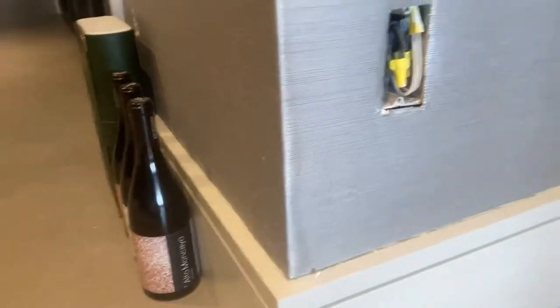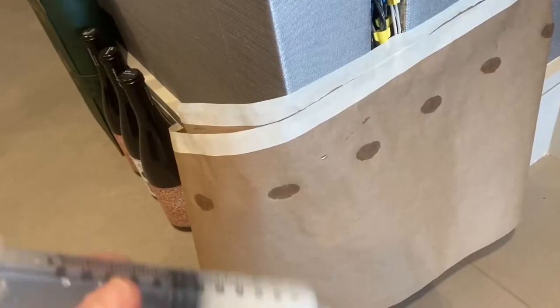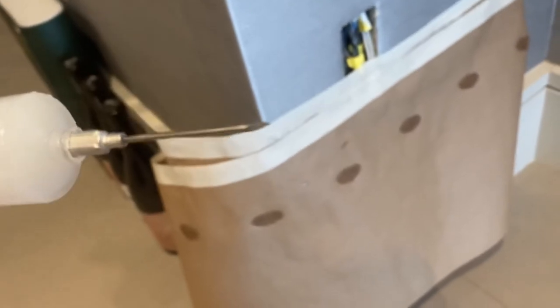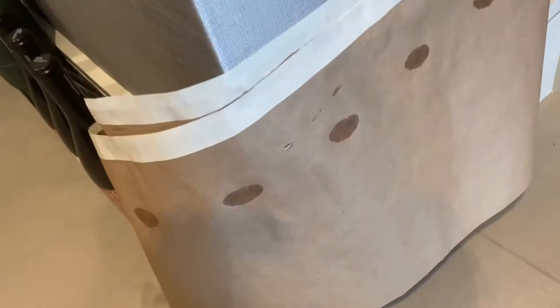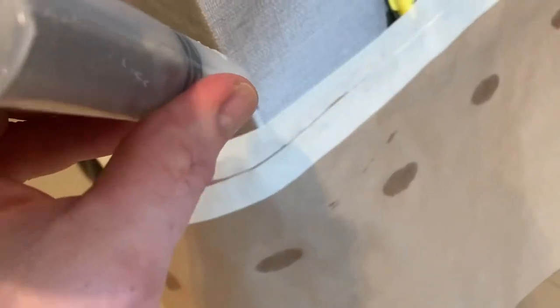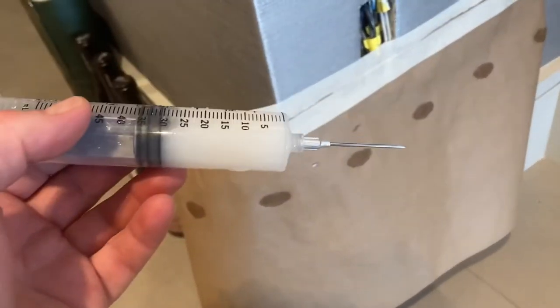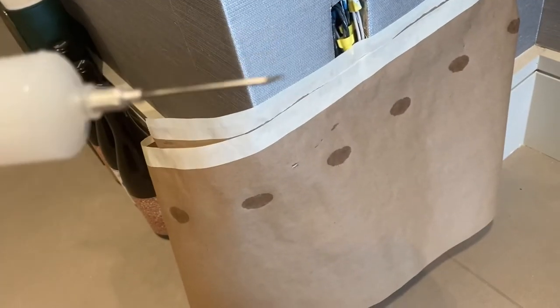A fat corner is caused by two things: an unyielding wall covering, which is Phillip Jeffries Manila hemp, and an irregular angle at the corner. In this case, it's an obtuse angle. Not only is the angle obtuse, but it's 90 in the middle, acute at the top, and obtuse at the bottom, meaning the length of the wall from top to bottom.